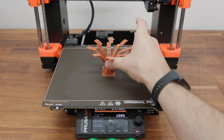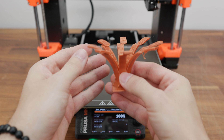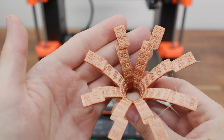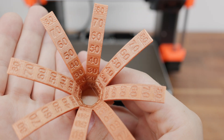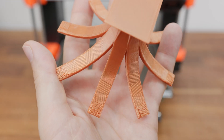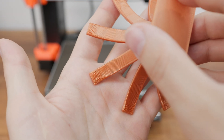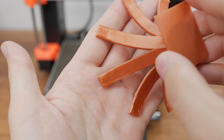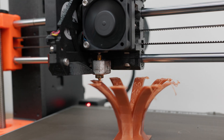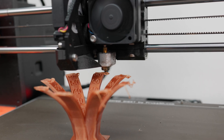Second, I printed a model with up to 80 degrees of overhang in 8 directions. Unfortunately, on the Prusa MK4 the nozzle hit the print and the motor lost steps — and when I tried to repeat this, it happened again. With the Prusa MK4S, the print ended up fine and all overhangs have only minimal flaws. The 80-degree overhang gave the printer a hard time, but the result is genuinely impressive.